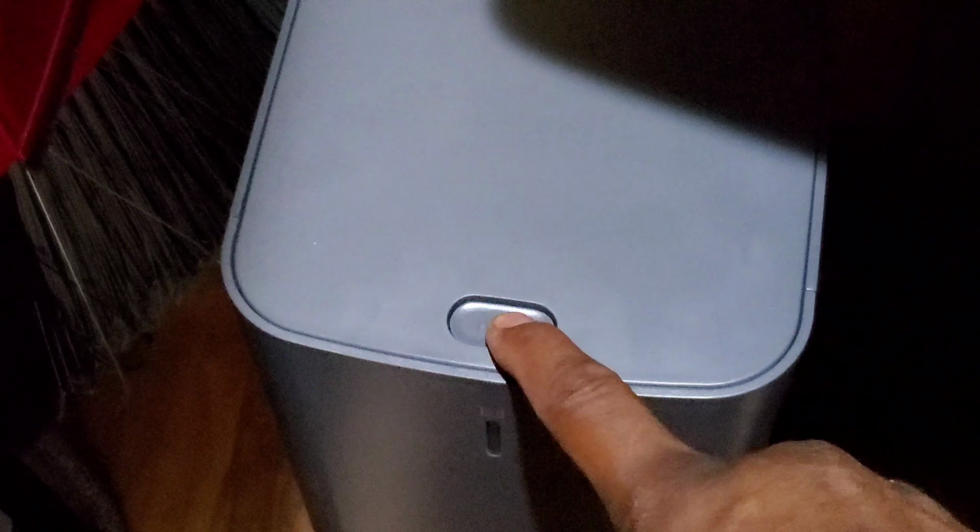All right. So I'm using the handheld screwdriver. If you don't have one, get one. One of the best purchases I made. Okay, then for this, we do have anchors. So you want to drill a pilot hole and then slide your anchor in there.